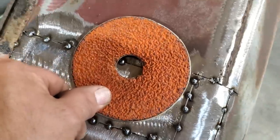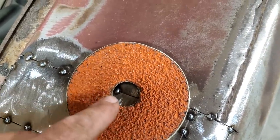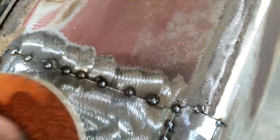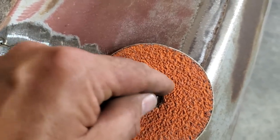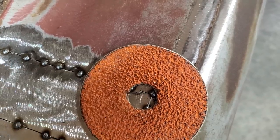When you're welding and looking down through that hole, this is a 3/4 inch hole, usually an inch apart. When you're in a zone like that, you weld there. But when you get into a corner, you have a tendency to weld there, there, and there. Now, all of those three spot welds are in that zone.